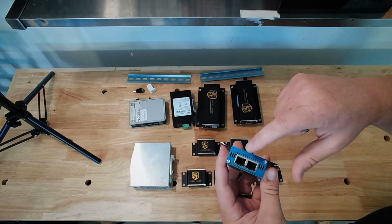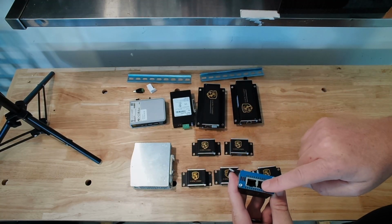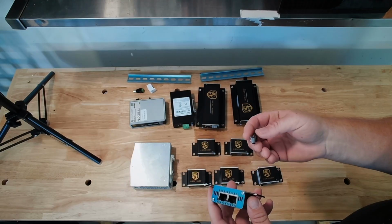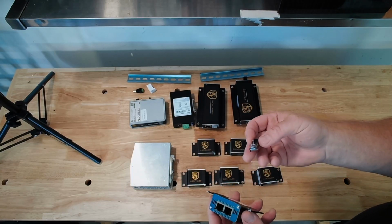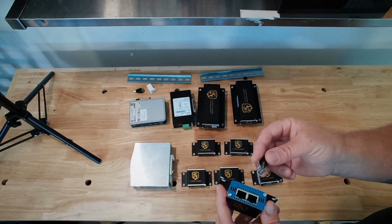So we're going to have one cable coming in from our previous device, and we're going to have an empty port. This is the terminator. This is the CAN bus terminator. For us in the fire alarm system or fire alarm world, it's a fancy end of line resistor or a shunting jumper on a RS-232 or 485 bus.